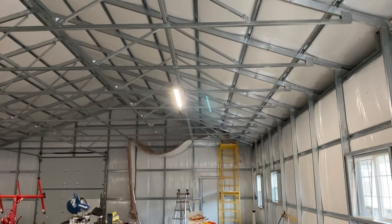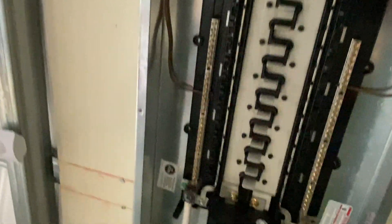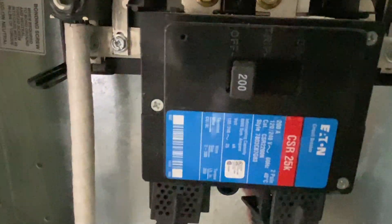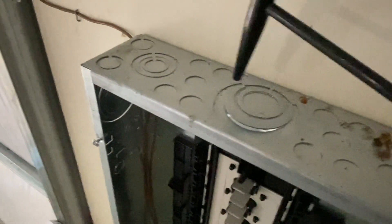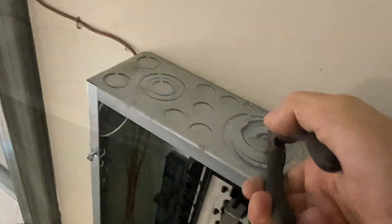I am going to be putting conduit up today. For those of you that may be concerned about how I'm working on this — each panel has its own breaker and this one, as you can see, is in the off position. To see which size I need to knock out, I'm going to use my handy dandy welder's hammer and just start knocking that ring out. I'm going to use my pliers just to wiggle it back and forth until the tab lets loose.